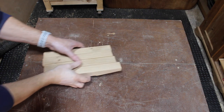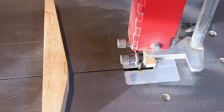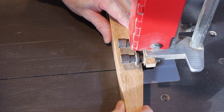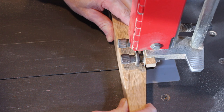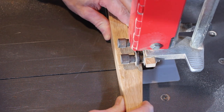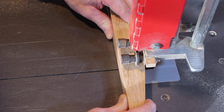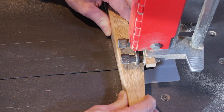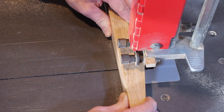And then finally just doing some sanding by hand to get all the edges perfectly clean, neat, and smooth. So that's all four legs ready to go. I'm now going to do a similar thing to what I did earlier with the bandsaw — I'm going to cut out a very small little dado, and this is for the cross section to fit inside. Carefully running the blade across to smooth it again.